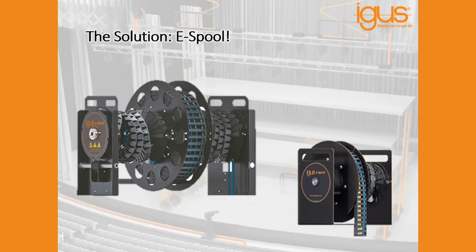So the solution to those shortcomings is the igus e-spool. You see a couple of different variants pictured on the screen here. The way the igus e-spool works is it uses a standard igus linear cable carrier, which I assume many of you are very familiar with. You'll see a 1400 energy chain wound up on that center drum in the e-spool, and then it's combined with a patented igus product known as the twister band. The twister band allows us to eliminate the slip ring that is found in many conventional cable reels and solve many of the problems that slip rings can potentially cause.